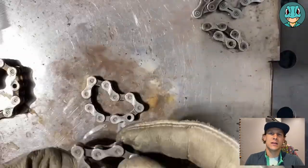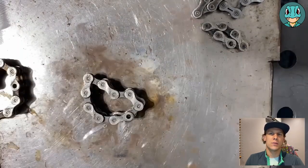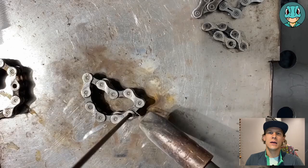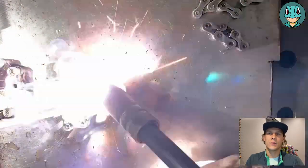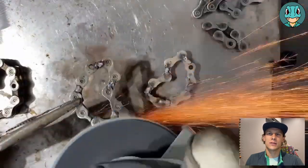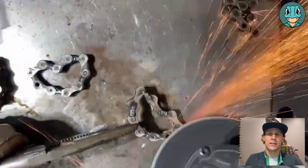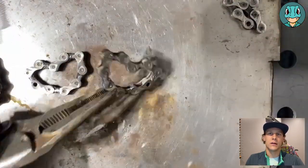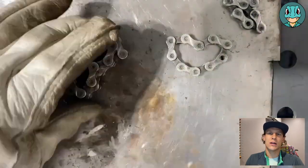We add on those smaller links to the side — just a smaller little lima bean. This is the piece I end up going with for the final design. I take out the middle portions and add in one of these smaller ones. We put in the rod, line them up, and quickly tack them so that we can get two symmetrical pieces. We clean them up so that when we put them on there, we have a flat side to weld and can hide some of those welds to keep the clean bike chain on the outside.